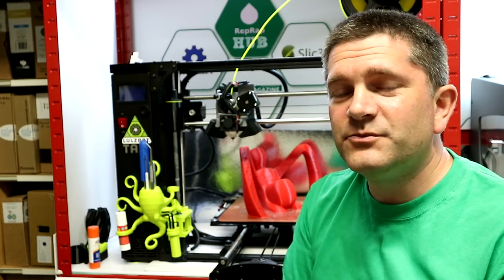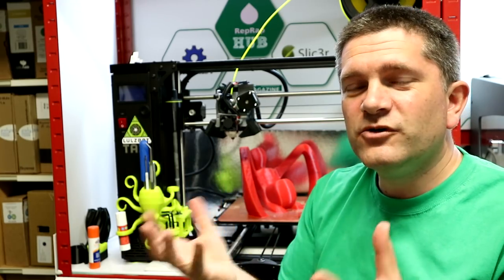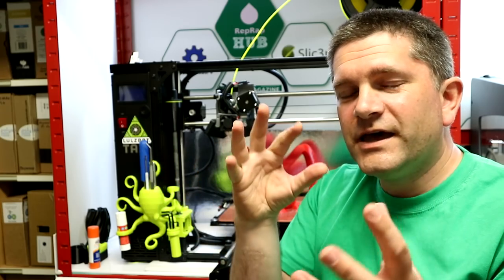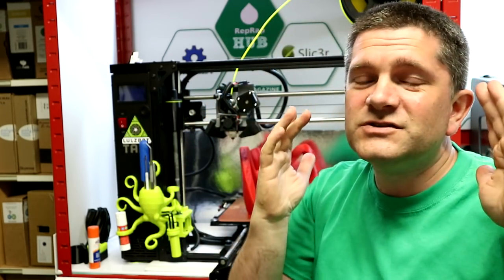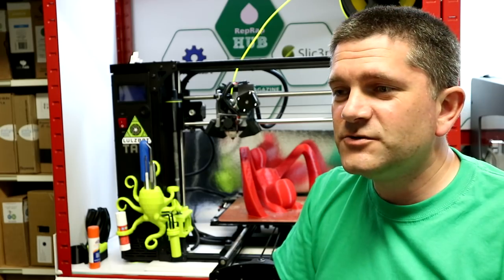That's it really — I just wanted to remind everyone that thermoforming after 3D printing is a really valid way of turning a flat or multi-part object into a more interesting design. Remember the hairy lion. The next time you're designing something, think about how you can make it easy to print and then thermoform it to create a more interesting structure. I've done this with headbands for my daughters — you print them flat and thermoform them in hot water to get exactly the right grip.